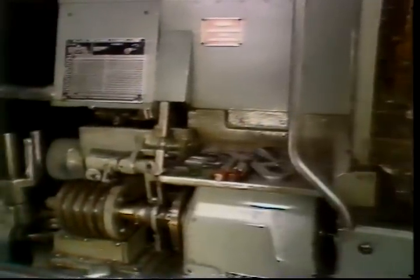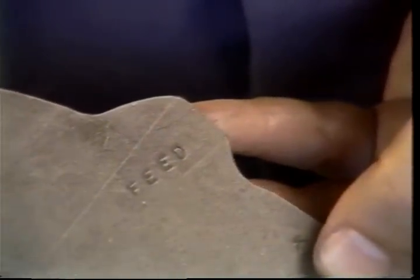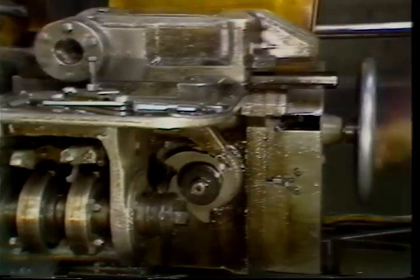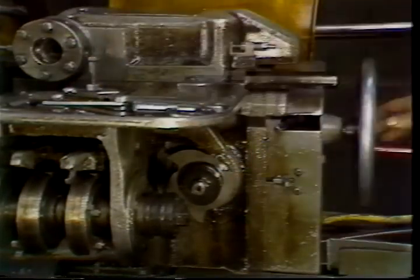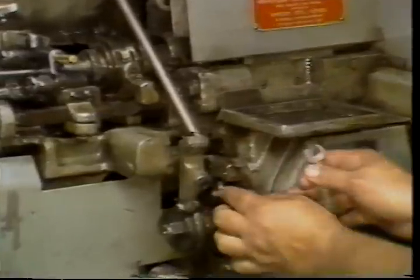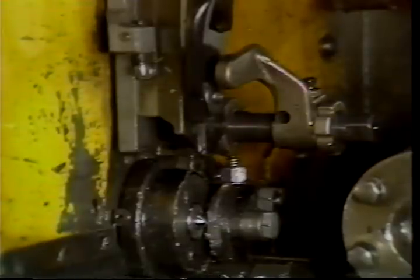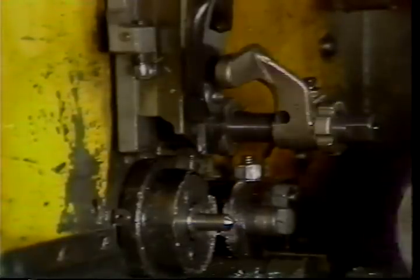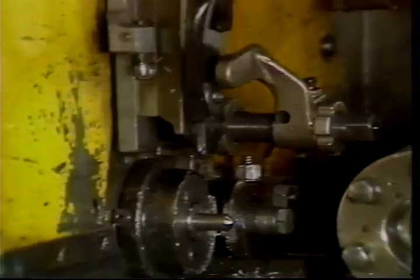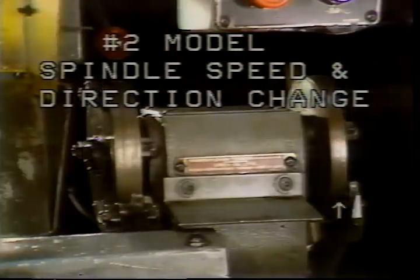The stock feed trip dog carrier is located here. If your setup is using a turret-mounted stock stop, there will be a lobe on the lead cam for the stock feed portion of the cycle. Hand crank the machine so the roller is on the top of this lobe, then set the trip dog to cause the feed out to occur. On setups that require swing stops, check your layout sheet to properly set the trip dog for stock feeding. Other trip dogs for spindle reversing and speed changes can also be set at this time.